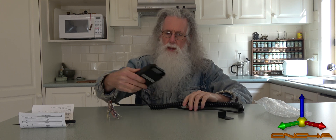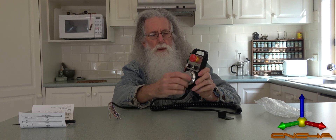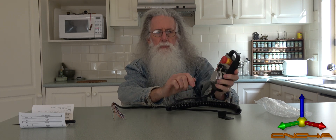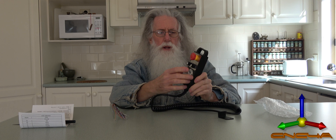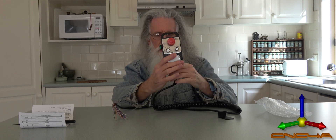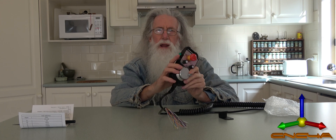You've purchased your controller and this one's got the emergency stop, the encoder, the axis and step selection, and it's also got an enable button to activate it. You can't be machining away and turn the handle while the controller is running - you cannot operate this simultaneously. There's a failsafe inside the controller. You switch it on to activate it, do your movements, take your finger off and it won't have any effect. So if something flies down, spins the handle, that won't happen unless you're still holding onto it.